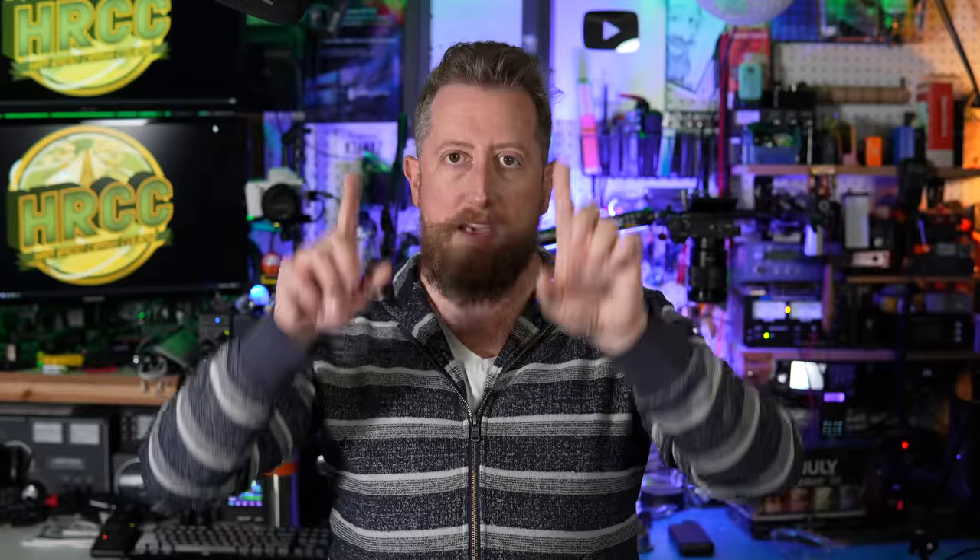If you have a bit more space to play with, you could potentially put up a fan dipole — just have the elements underneath the 20-meter elements for 15 and 10 meters, etc. You could also explore switching them like a maypole antenna. That's generally an inverted-V type setup, like a teepee, but you can have them going in different directions and they won't cause a big problem to each other. I'd recommend that you at least try to get a 10-meter antenna up. That's going to be a very important band in the next two to three years, so make sure you include 10 meters in whatever you're planning. It's not going to be an all-the-time band right now, but it's definitely going to pick up in a year or so.